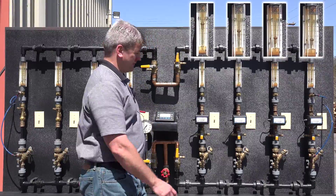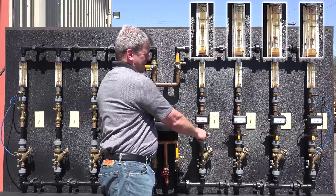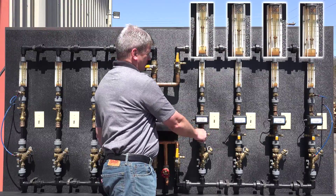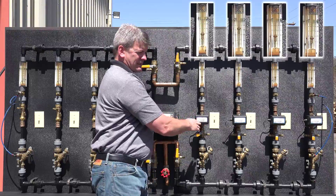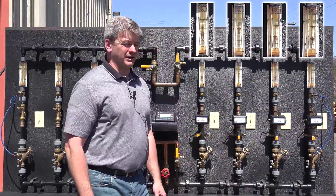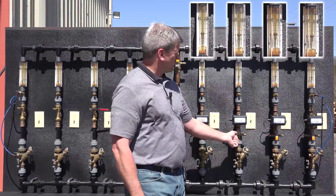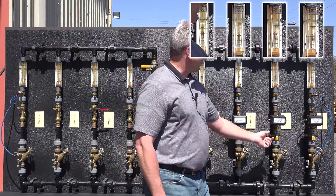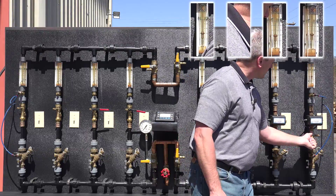As we come into balance, we probe across our ports on the manual balance valve. We set differential pressure — in this case we're going to balance to our flow meter. You'll see that as we set additional resistance to the first branch, we're increasing flow to all the other branches. We move on to the second branch, adjust to 2 GPM, continue to the third branch, fourth branch.